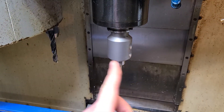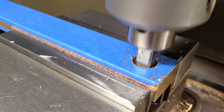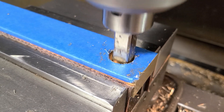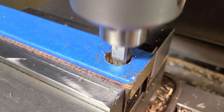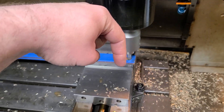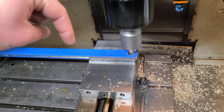It's gonna do M19, lock the spindle. So it cuts two thousandths this way, two thousandths this way every time, so it goes in a diagonal. Every time it's at the bottom of the hole it retracts five thousandths, goes back up and retracts again.